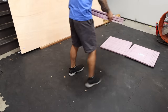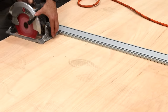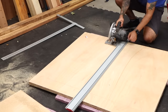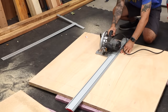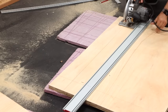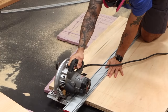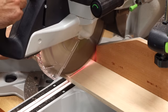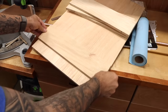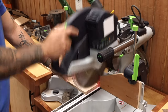I usually like to cut plywood down on the floor. I use foam insulation boards as a sacrificial surface. First, cut the sheet in half. Next, cut the 16-inch wide strip. That one gets cut in half to make the top and the bottom of our box. Now cut the box sides and back support stretcher. Reference the cut diagram in the plan for all the details. Cross-cut the two box sides to length — they should be about 16 inches, but it's best to hold them against the top and bottom pieces to make sure they match up. Cut the support stretcher too while you're here, just keep it a little bit oversized in length.